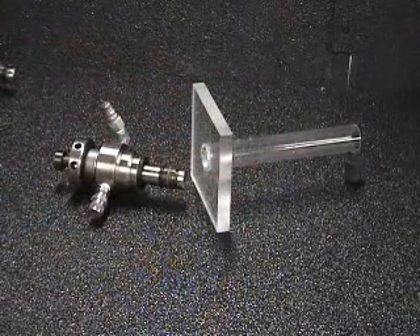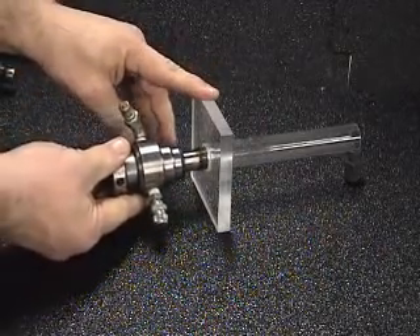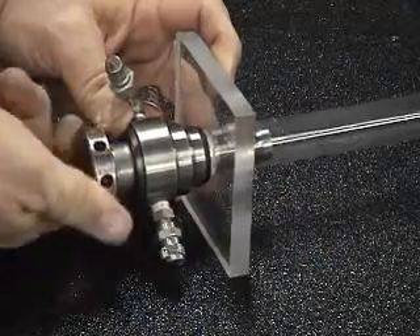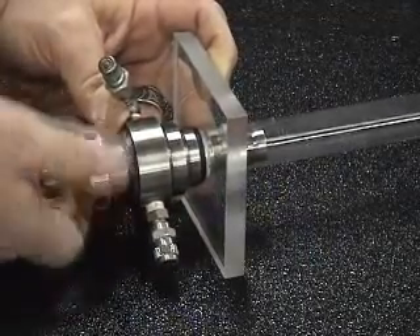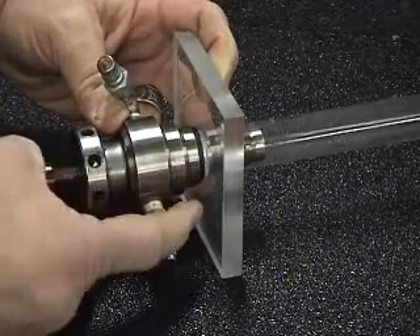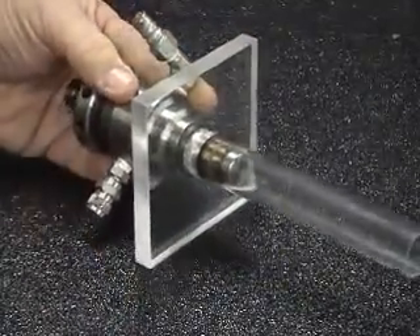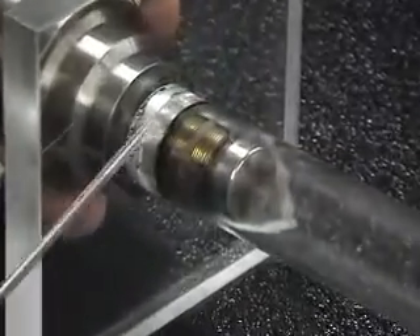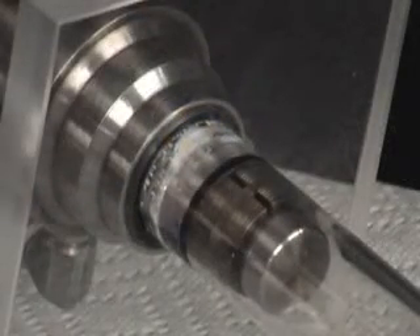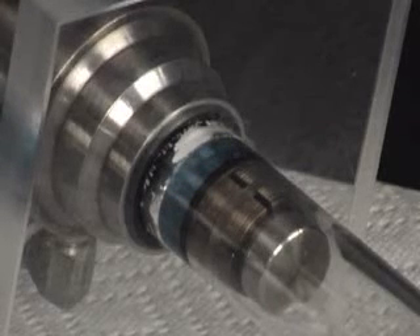Installation of the Hydroproof joint testing tool. Insert the mandrel into the tube, pressing the face seal against the tube sheet. Turn the engagement nut. This will draw the collar into the face, creating the seal with the face seal. The segment will engage, opening the O-ring to create the seal inside the tube.